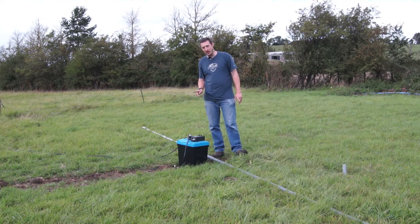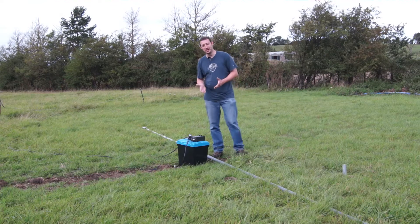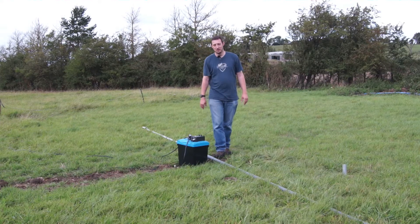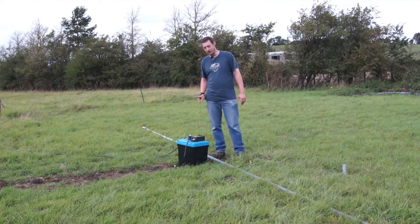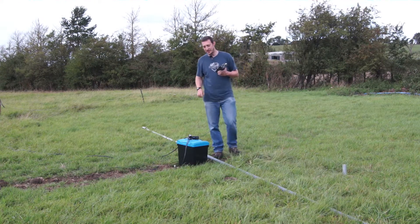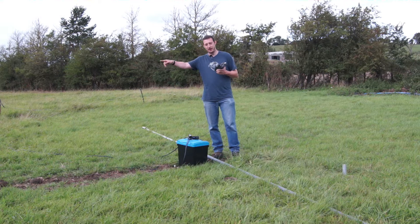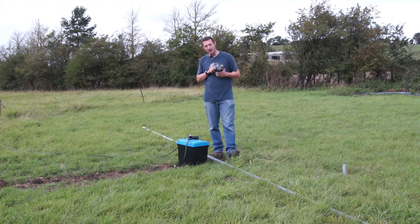This gives me the opportunity to talk about coax cables, because the one thing that a lot of people get wrong is they go out, they buy an expensive radio, they buy an expensive antenna, and then they go and feed it with RG58. Especially once you get up on the VHF frequencies around 144 to 146 megahertz and the two metre band, you can get a lot of loss in that cable. I've got an MFJ antenna analyzer here which I can actually test the loss in the cable, and if you've seen my previous videos you'll know this blue box here contains a feeder for the big quarter wave that's over there - it's about a 50 metre long run. I tested it and at 144 megahertz I'm losing 3dB.